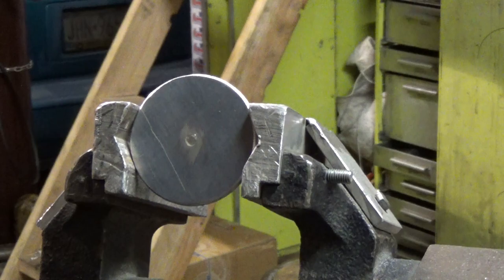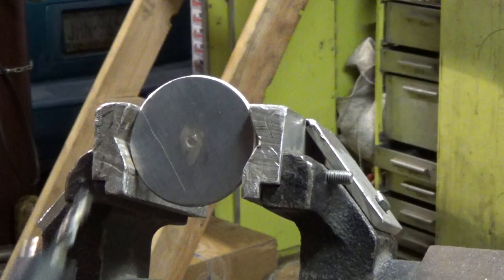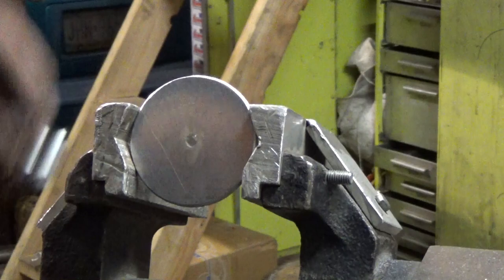I'm starting out by setting up the bottom plate for the catch can. It's a three-inch cap plate with a hole in the middle. I'm about to hole saw it out some more so I can fit my bung in there nicely so I can weld it.